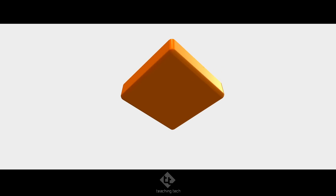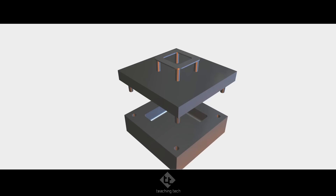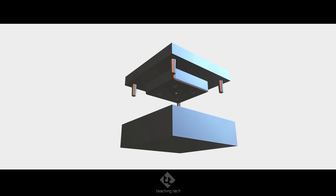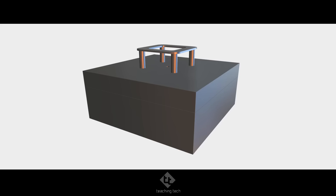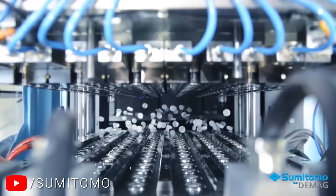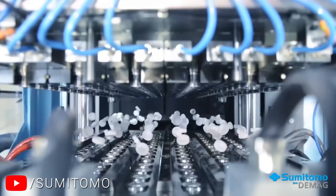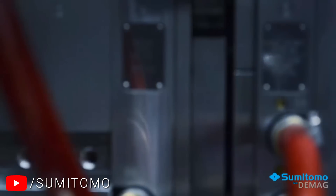To make even the simplest of plastic parts, we need to invest in tooling — or as the name might suggest, a mold. At a minimum, this mold will have two pieces, an upper and lower half, and in each of them is an imprint of the object we're going to make. When the part is made, molten plastic is inserted down a runner, squeezing it through into the extents of the cavity. The plastic will quickly cool and the mold can open. Ejector pins push the part free of the mold, where normally gravity will set it free. My animation is slow because in reality this process is extremely fast and efficient, with the tooling being made to produce multiple objects in only seconds.